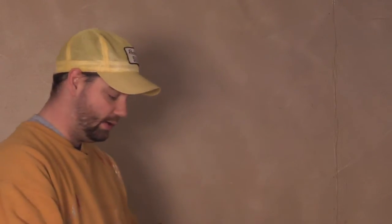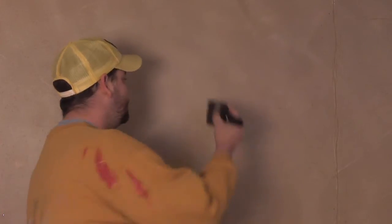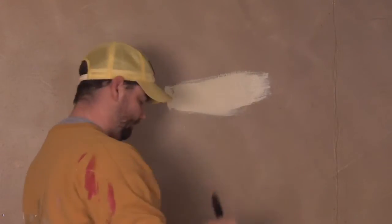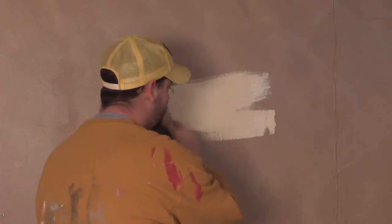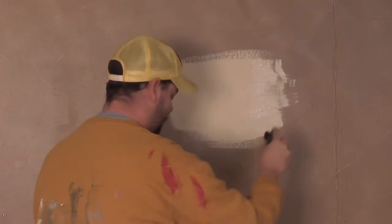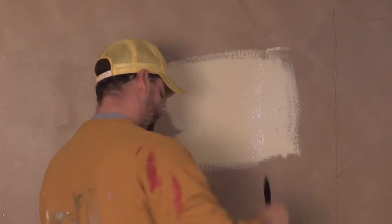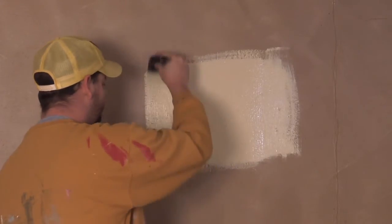The first technique I'm going to show you today is called combing. It's called combing because it's done with just a simple little household comb that you can find anywhere. To get this project started, you're going to start with a four-inch brush. You're going to want to make sure it's nice and malleable, nice and wet. Then you're going to take your top coat — I just got this nice creamy little yellow here — and you're going to put it on very thickly. You're going to want it to be pretty dense on the wall. You don't want to put a thin coat on, because if you put a thin coat on, it's not going to work for what we're trying to do here.